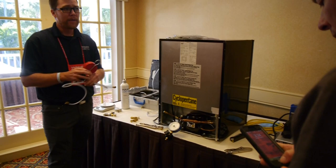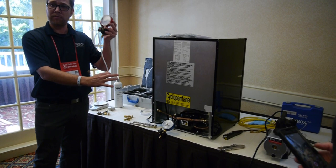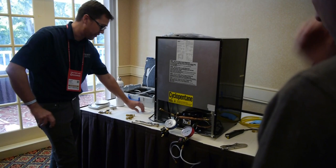The setup today is a configuration for connecting both sides of the manifold. I also want to show how to get rid of the liquid, because if I'm taking a reading on the high side, it's going to be filled with liquid refrigerant — that was part of my initial charge and I need to get it back into the system. If you're not familiar with using four-valve manifolds and getting refrigerant from the high side to the low side, this will show you that. That's why we go through the entire hookup, not just a one-sided setup.